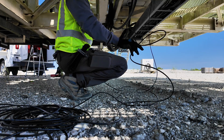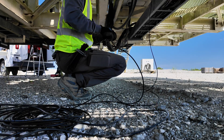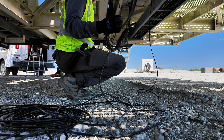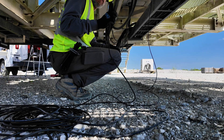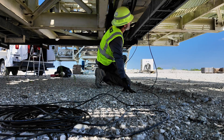We've got LC single mode fiber connectors on one end of the cable already. On the other end, just run them into the enclosure, into the din rail housing. Splice six single mode LC connectors on the end, test it, label it, and call it a day.